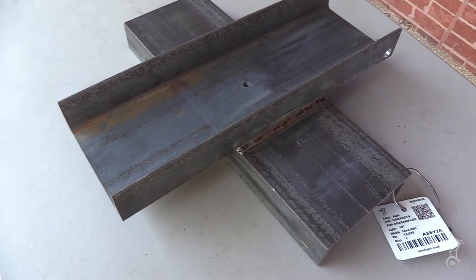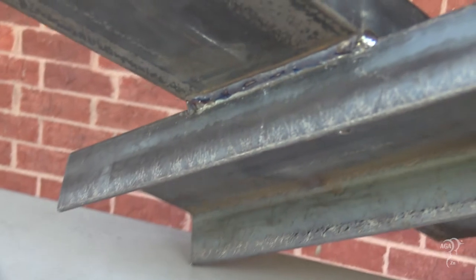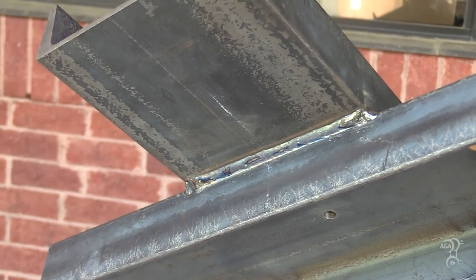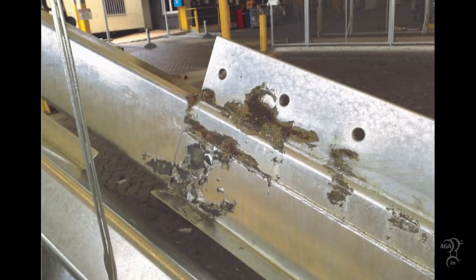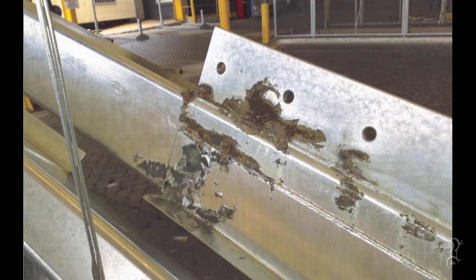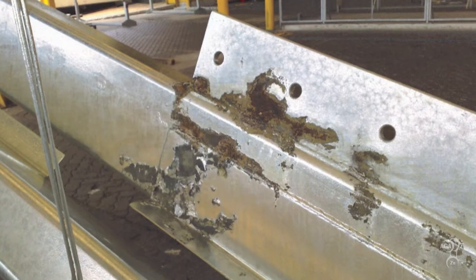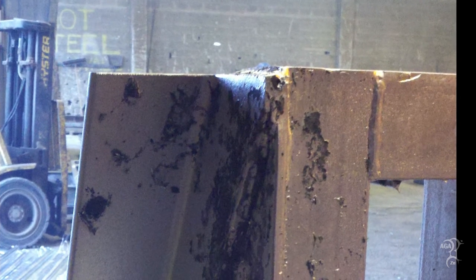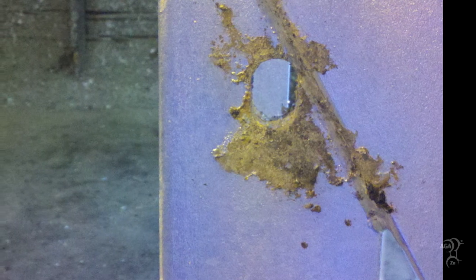Fabrications which feature sealed areas or overlapping surfaces require special attention to welding details and weld quality to avoid two different surface issues. The first is weld blowout — a bare spot near a weld or overlapping surface caused when cleaning solutions in the galvanizing process penetrate the area and then boil out during immersion in the zinc. When the liquids blow out, they create localized contamination preventing the coating from forming. Weld blowouts are not acceptable without touch-up because they create bare spots.